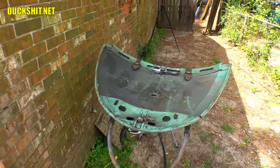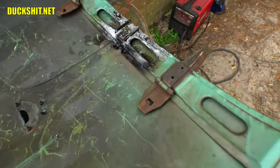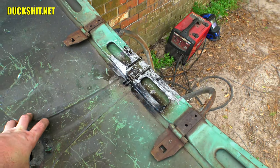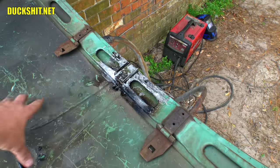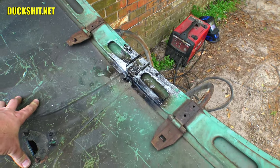That wind sure picked up out here — it's going to storm like the Dickens later today, and this is the precursor of it. Anyway, we're still working with this deck lid. Actually, I'm just about finished up. I went ahead and coated it with some cat piss — for those of you that don't know, that's phosphoric acid, aka Ospho. There are links down below in the video description. What that does is it prevents rust from coming back. I don't know how soon he's going to get this thing painted, but this thing is solid once again.